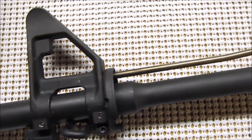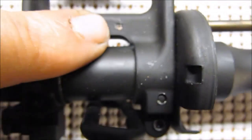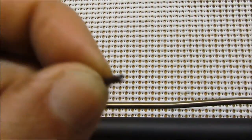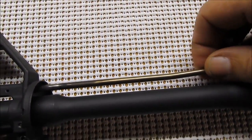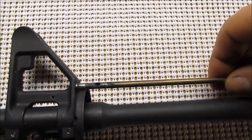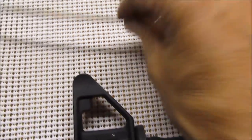As you can see, we've got our pin out — that's what it looks like. Now to take the tube out, typically what I do is pull the tube backwards a little bit, kind of rotate it around once it starts to come out. Don't pull really hard on this gas tube because you don't want to bend it — just wiggle it and work it nice and easy until it comes all the way out.